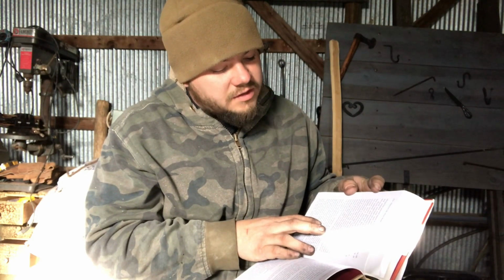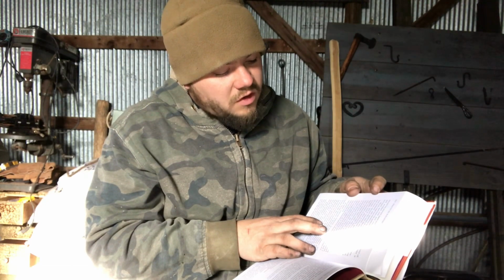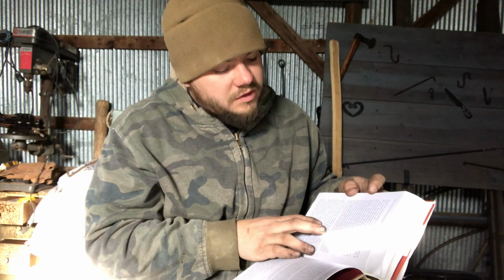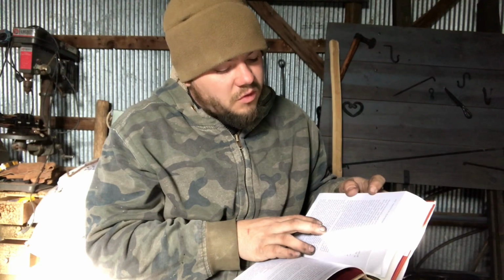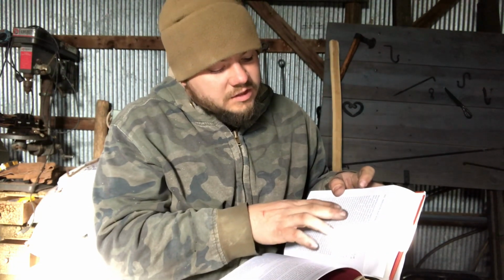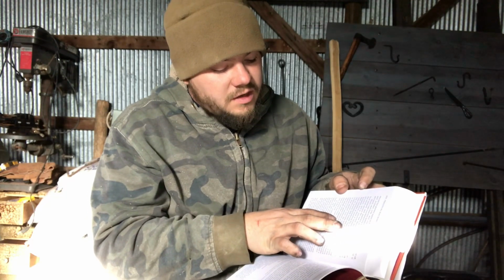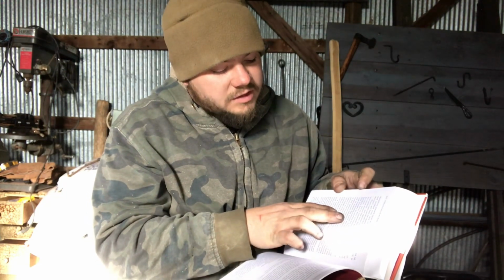Since, however, it is an expensive process, and is unsuitable when the article is large and of a regular form, what is termed box hardening is employed. This is another name for pack carburizing. This consists in packing the articles in a box and closing the case hardening materials. The box is made airtight by having its seams well luted with fire clay.